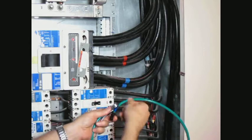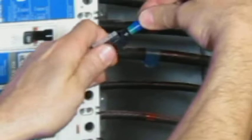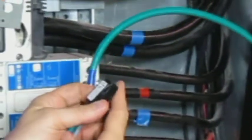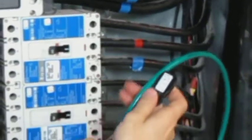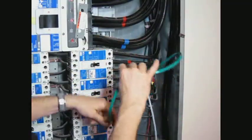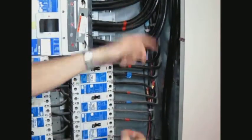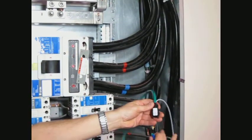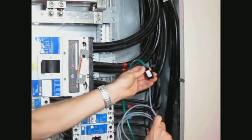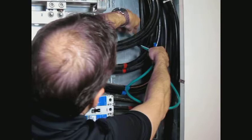This is a 5000 amp coil. You can see how they fit together. The important thing with Rogowski coils is to look at the direction of the current. There's an arrow there, so in this case the current is coming from the utility toward the panel, so you see our arrow is in the direction of the current as we put the Rogowski coil around the cable.